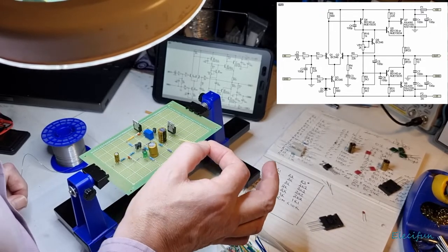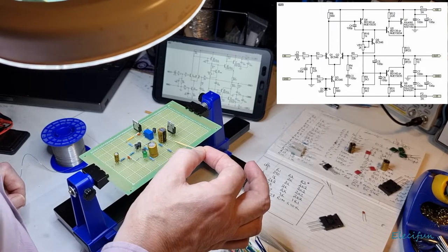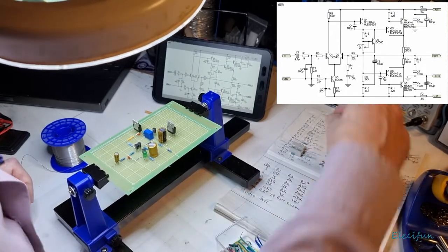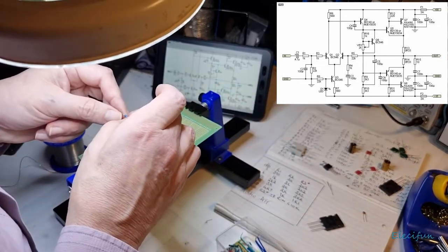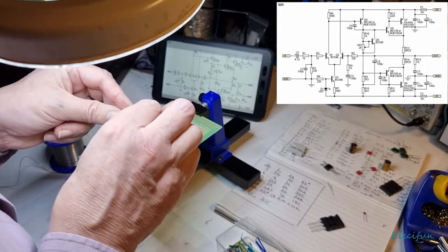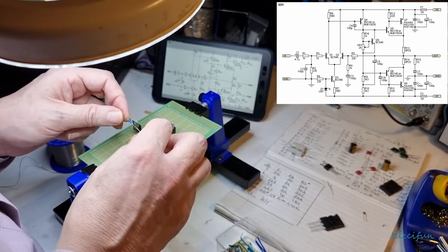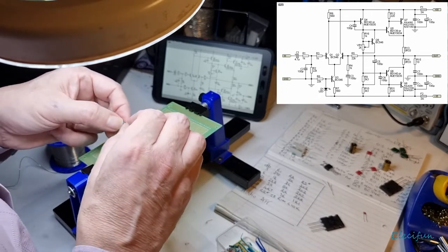We're going to have a resistor coming off this collector going down to the negative side of our rail. That's a 220k. We'll pop that in now, that's two reds and two blacks, 220, and then we got the kilo at the end of there. Well, it looks like it's brown, but I think that's 220k anyway, or 220 ohms I should say, duh.